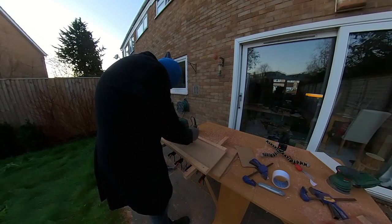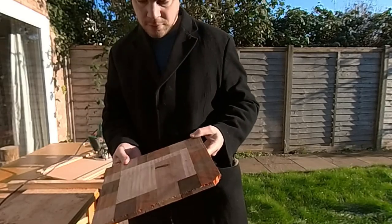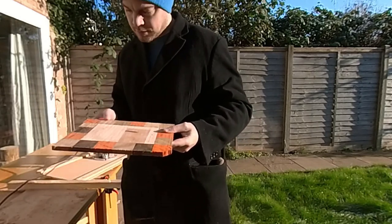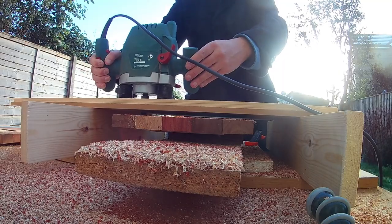You'll find that this process leaves a lot of marks on the surface from the router bit, although the higher the quality of your tools and your jig, the less obvious they'll be. You'll still need to sand it heavily once you're finished, but I haven't done that with these pieces, as they need some more gluing and probably another run through to flatten them once they're fully assembled.